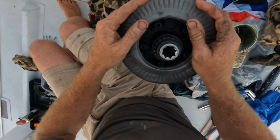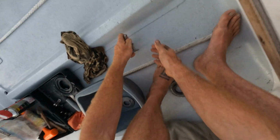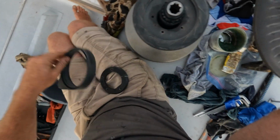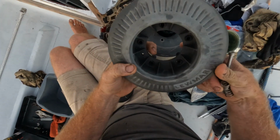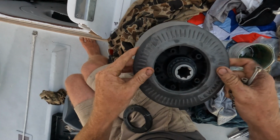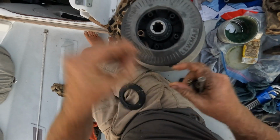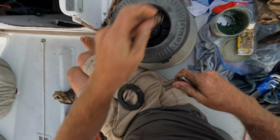Come on, buddy. Okay, good. And then we get our bolts, then we get our newly fixed little components. Oh, we have messed up there. Ta-da! We need this bit on here with the cup down. This is the little piece that locates the stripper or the feeder or whatever you want to call it, the little bit that kicks the rope up into the self-tailer and strips the rope out of the self-tailer at the same time. We'll see in just a second.